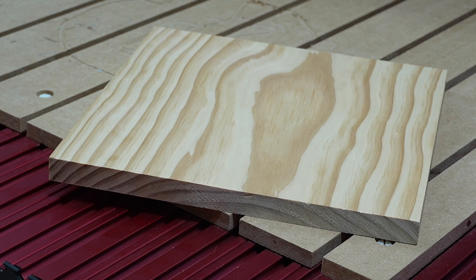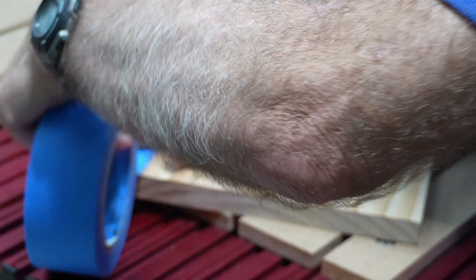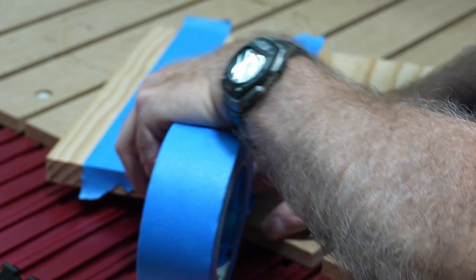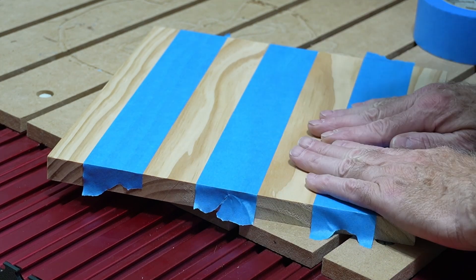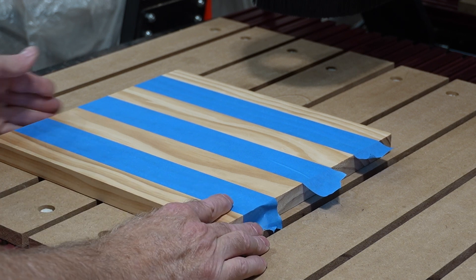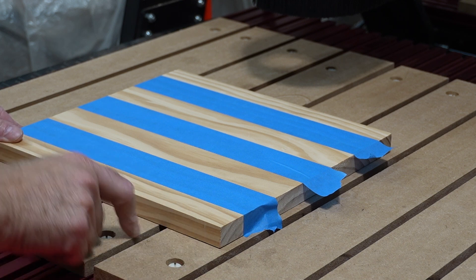Here's what you need to do step by step. Step one: put the Blue Painter's Tape on the back of the project you want to secure to the spoil board. This is a 12-inch by 12-inch piece, so I'll do three pieces, trying to equally distribute them across the board. Push down to make sure they're secure. Next, decide exactly where you want to place the project on your spoil board — I usually try to run it parallel to one of the grooves. In this case, it's almost exactly four boards wide.